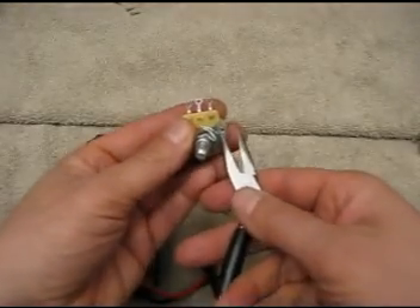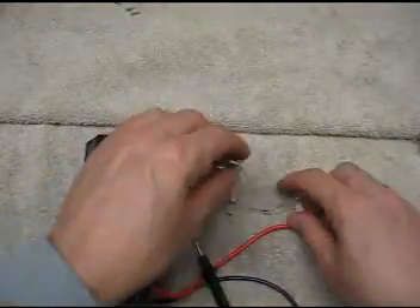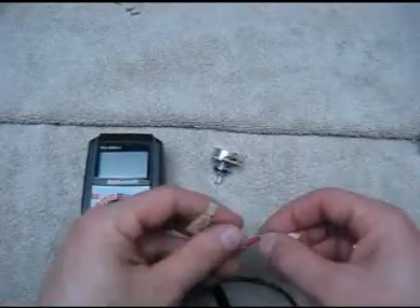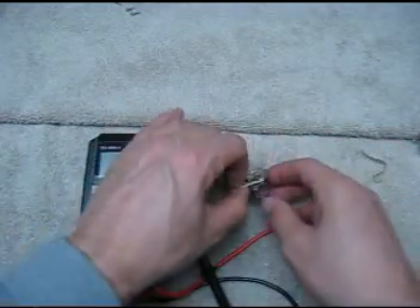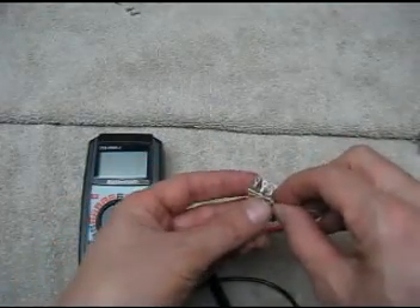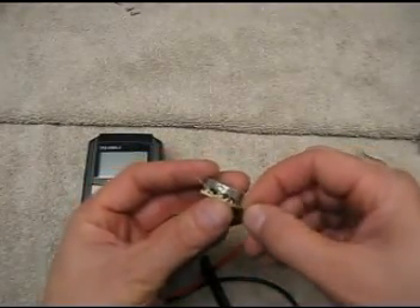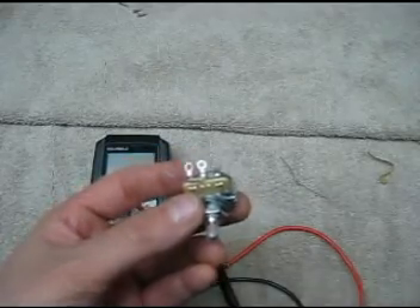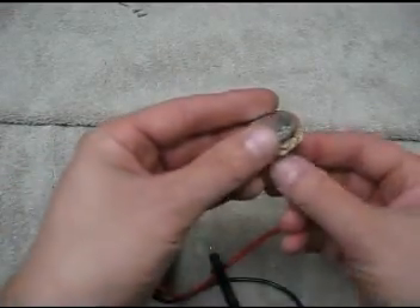In the old days I would have been really picky and thrown that pot out, but I don't worry about that stuff as much as I used to. One thing I definitely do — these are 500k resistors, and what I do is tie them around the volume control so the taper changes. Give me a second and I'll show you how that works.